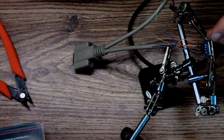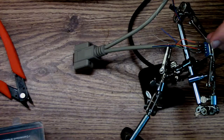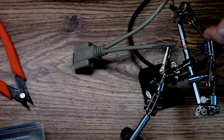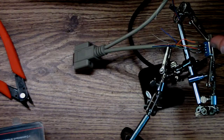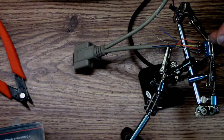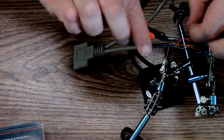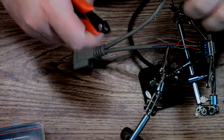Black, okay. Pin 6 is lavender. Lavender goes to pin 4. Pin 4 is yellow. Boom. Pin 7 is open. Pin 8 is yellow, and it's the second yellow, which goes to pin 2, and pin 2 is red. Bang. There we go. Okay. So, controller B is done.